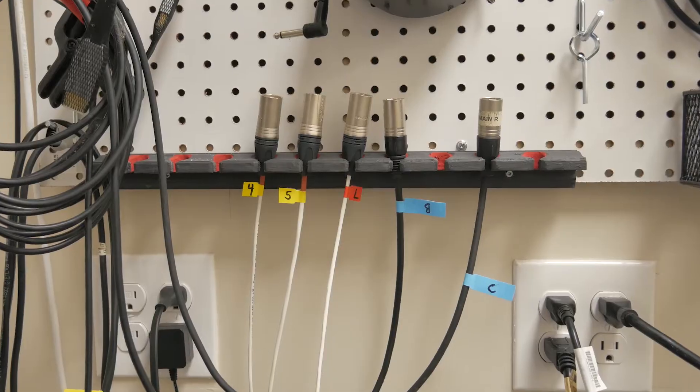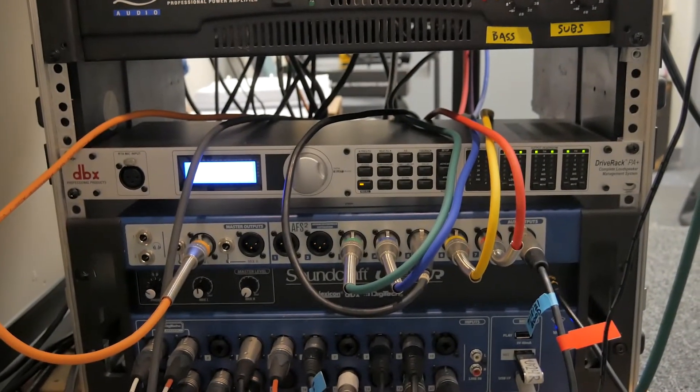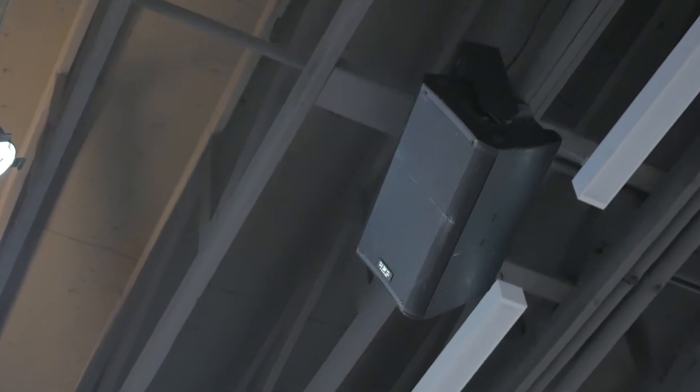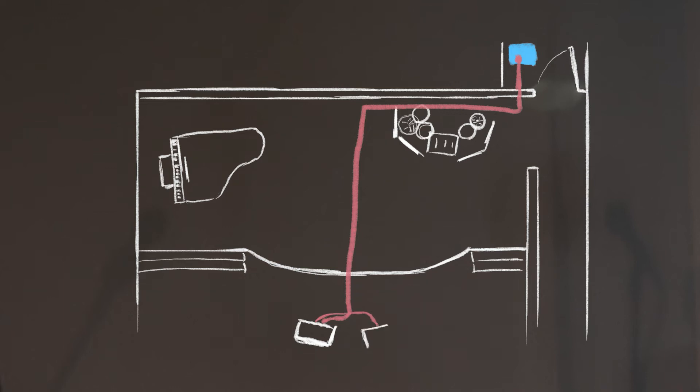In the backstage room, there's a little rack to hold unused cable ends to help keep them off the floor and untangled. That gets all our signals to the mixer, then the mixer does its thing — more on that in the next video — and sends the mix signals back out. We're mixing in mono at the moment, so we're only using the mixer's left main output, which goes to the rack-mounted sound processor, a DBX Drive Rack PA, which does some extra sound processing and also acts as a crossover, separating the mid and high frequencies sent to our main speakers from the low frequencies that go to the subwoofers. The processed main channel goes straight from the Drive Rack PA to one of the speakers mounted from the ceiling. Those speakers are self-powered active speakers, so the power amplifier is built into each speaker. Since it's a mono mix, we can take the output of one speaker and run it to the other.